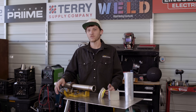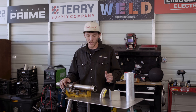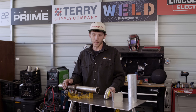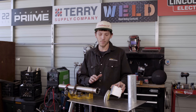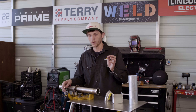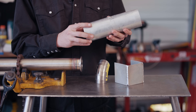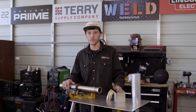We've got our stainless steel tubing weld made here on this two-inch tri-clamp ferrule. This is very widely used when fusion welding in the process industry. I've used this application for years and haven't really ever seen any welds break or fracture. On the titanium as well, the tacks alone hold really well — that tells you it's a very strong weld. The aluminum pieces we did — not so applicable. Only when I'm trying to tack something and can't use the other hand for filler wire, or when fitting thin tubing, is when I need to fuse weld.